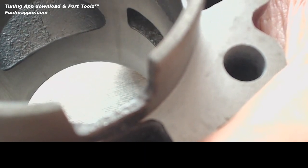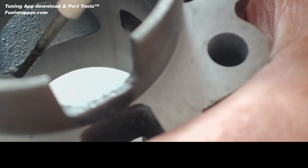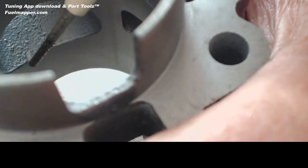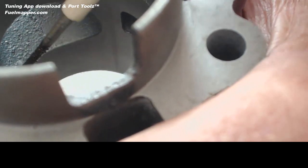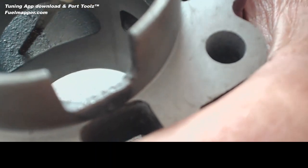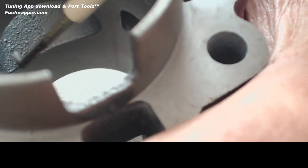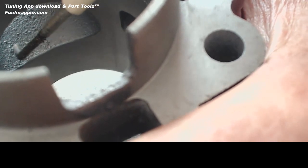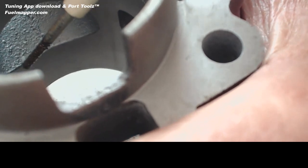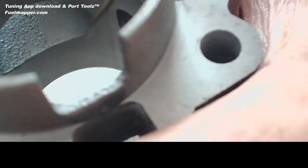Here we're looking at a typical cylinder and we can see there are a lot of bumps here - casting defects. This is going to prevent us from filing this edge because the file jumps as it goes over these bumps. We're not worried about the bumps themselves - these are minor and they aren't going to create any major problem. The major problem is just here on the edge where we need to reduce them down and get them flat so that we can go to work on the edge.